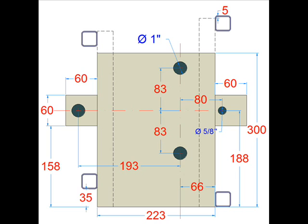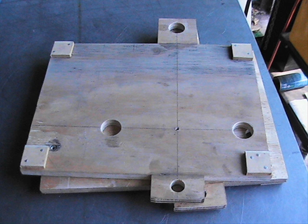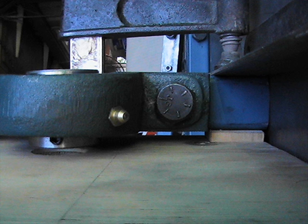Then glued the side blocks in place. This avoids all the hassles of having to cut it out of a single piece of ply. When the side blocks are set firm in place, precisely screw the two parts together at the approximate locations as shown in the picture. Mark out the locations of the shaft holes and drill out on a drill press to ensure that the holes are perpendicular. The next step is to fix to the outside face of each jig piece a small 6 millimetre thick block of wood. These spacing blocks are required to give clearance due to the protruding bearing collars.